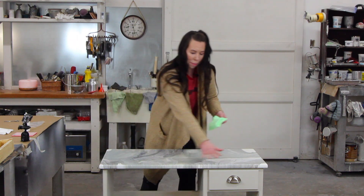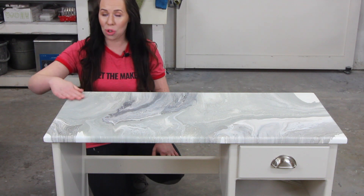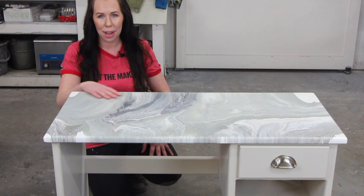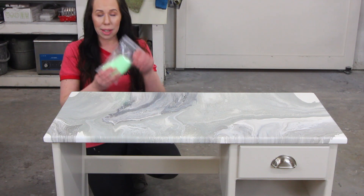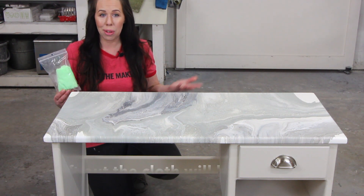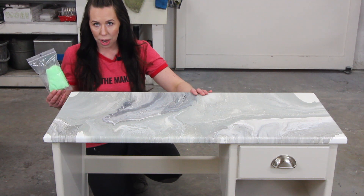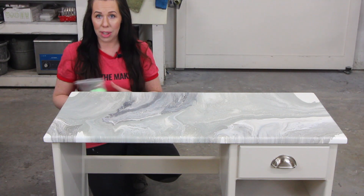When applying this final coat, make sure not to go over a freshly applied area — just let it dry. The final coat is on and dry to touch, and I'm going to let it cure for about a week before moving it into its proper home. A couple of tips: make sure you store your cloth in the bag sealed up — you don't want to leave it lying around because dust particles can fall into it and transfer onto your dried piece of furniture.